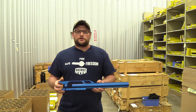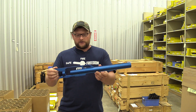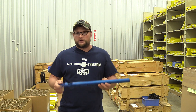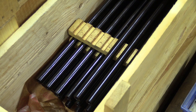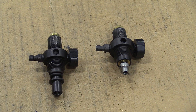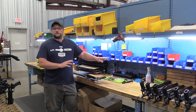We've got our parts back from the anodizer. You can see that this one's been anodized blue — they do a couple of different colors for some of the models. Most of the anodizing is done in black because everything looks good in black, right? This blue extrusion has been machined, it's anodized, and it's ready for quality control inspection and assembly. We can't forget about the barrels either — the Lothar Walthers we saw earlier. We sent those out to the bluer and got them back. These are .308 caliber Texan barrels, all blued and ready for assembly.